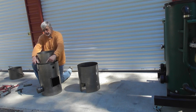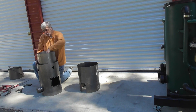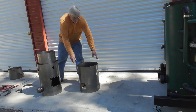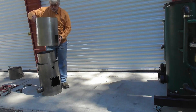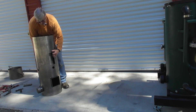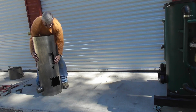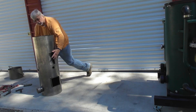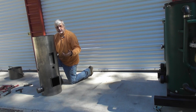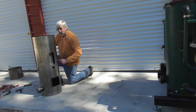So that's going to go in there, we're going to do the weld here. At this point we could do a reservoir test if we wanted — put water in here, put some putty across here, weld on the inside or outside or both. Or we could just put the top of the tank on and go to the next layer. This opening here is going to be for the heat exchange. We're going to put in our divider plate here, put our heat exchange here. Now we can weld this top on, and everything should line up because in the previous video I showed you how to use the straps and the turnbuckle to make sure everything is round. So these two pieces' liner should line up pretty good, and we're going to weld the outside of this liner here as well.